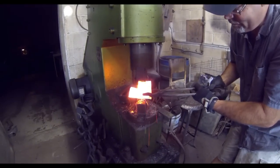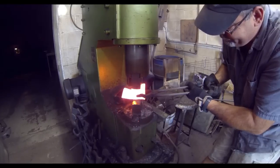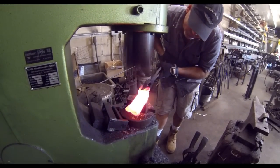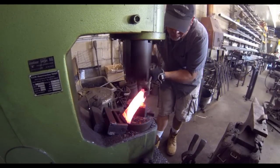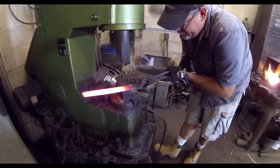The project started when I went to my friend Jason Northgard's blacksmith shop and he took that iron hull plate and started to forge it flat. This was quite a process — he hammered it for a long time, hammered it flat and elongated it. The end result was a billet about a quarter inch or three-sixteenths in thickness and about 10 to 12 inches in length for the knife.